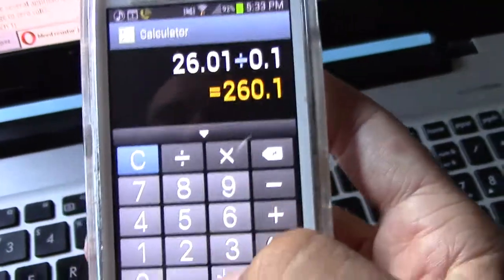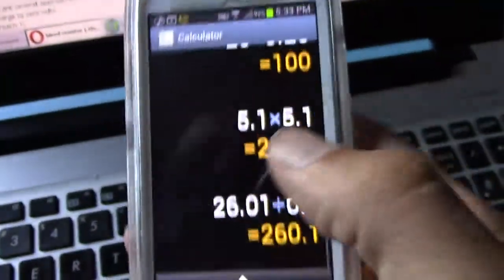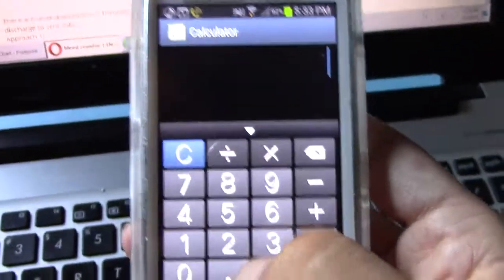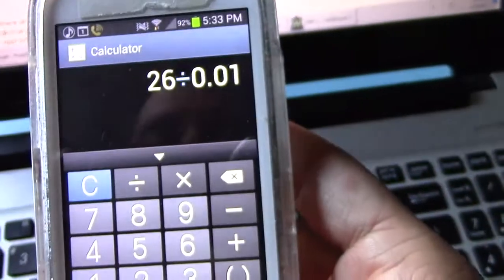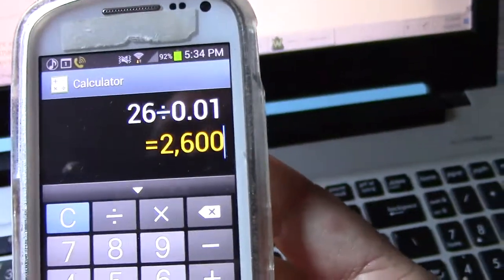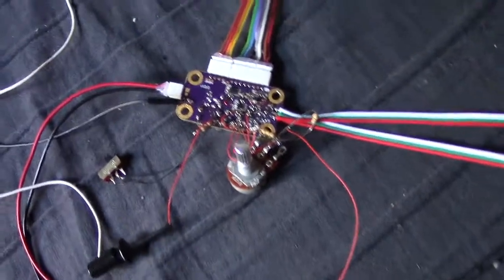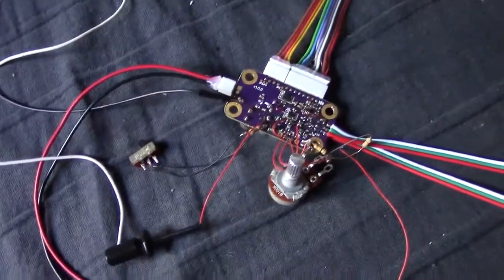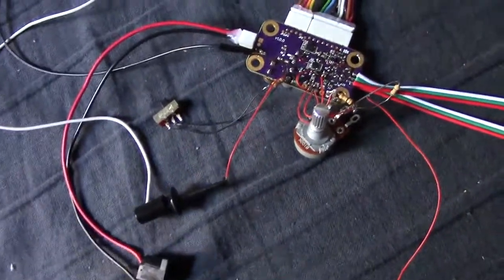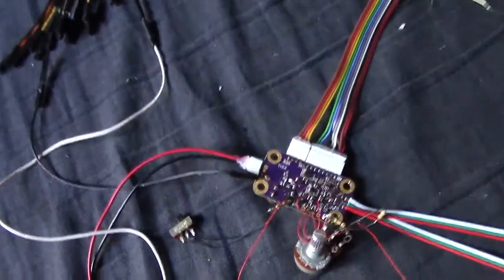And so, if you wanted to do even less power wasted, because this is for a battery, this is for a portable circuit, let's do .01. That's a really small amount of power. Yeah, 2600. So, because of that, I would recommend, for my specific example, for a 5-volt situation, any resistor between, theoretically, you could go as low as 200 with a regular 1/4 watt and be safe, all the way to 2600. And so for my rough values of safety and conservativeness, I'm saying, let's say between 470, which is a standard value, and 2K2.